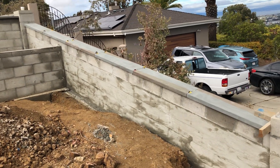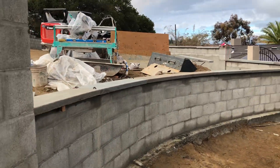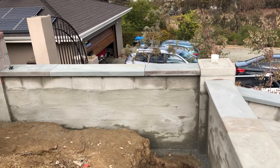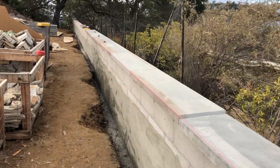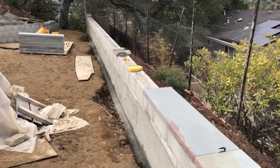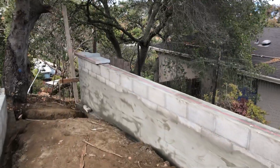The stone guys have started laying the full range bluestone cap. They started yesterday morning — they measured, cut, flamed around the corners, and they've got this installed as well. My stucco guy was out yesterday; he said he's pretty busy and once that first rain comes along everybody gets panicky, so it'll be a little while before the stucco gets installed. We'll have stucco on both sides, which is the reason we have almost two inches hanging over on the wall — he's going to need about seven-eighths of an inch.